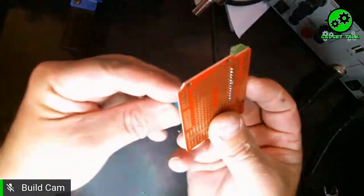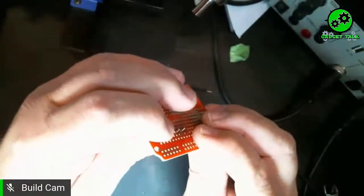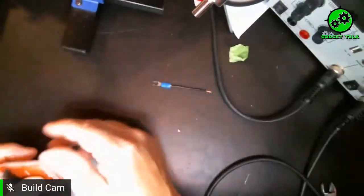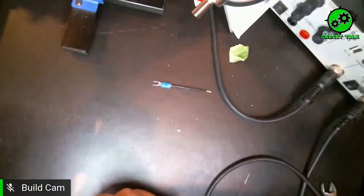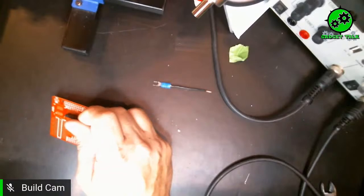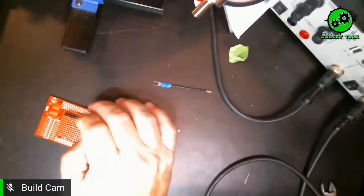If you do something like this in there, same thing. These are easier to solder because they're easier to see. They just pop in wherever you want. Right. Resistors. So once again, your technique is that you put your soldering gun underneath the pin or the wire, and you put the solder on top. So you're heating up the pin, and it will suck it down into itself. Correct.